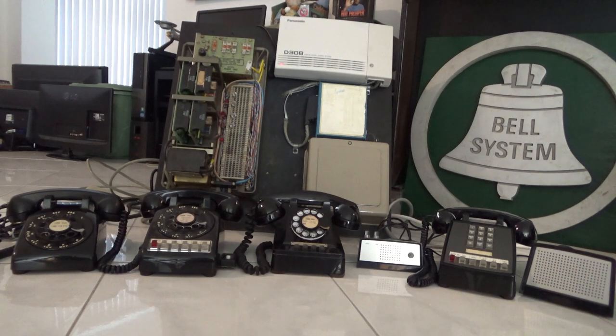The third phone is a 454 Western Electric — a four-button key set with hold and three lines. The first three lines of the 1A2 appear on that phone. Since it's a four-button set with only three lines, there is no fourth line and no fifth line for intercom. The system is wired as a squared system, so all phones have the same line appearances regardless of phone type — squared at lines one through four, with CO line five as intercom.